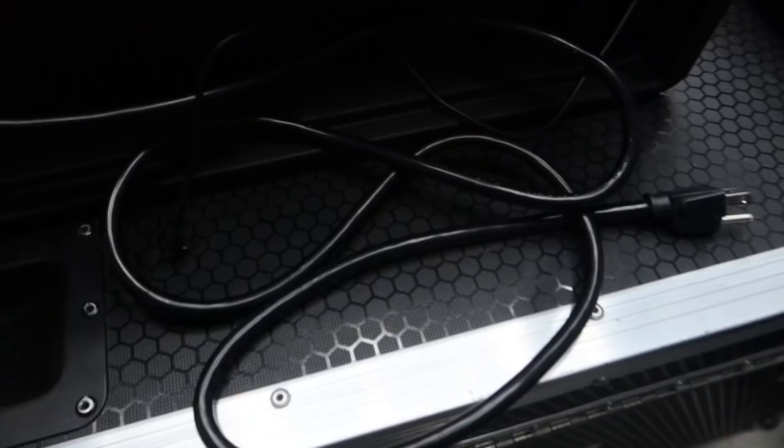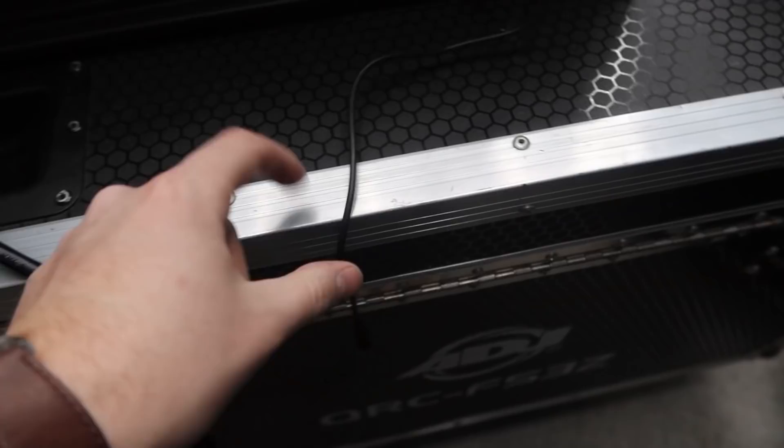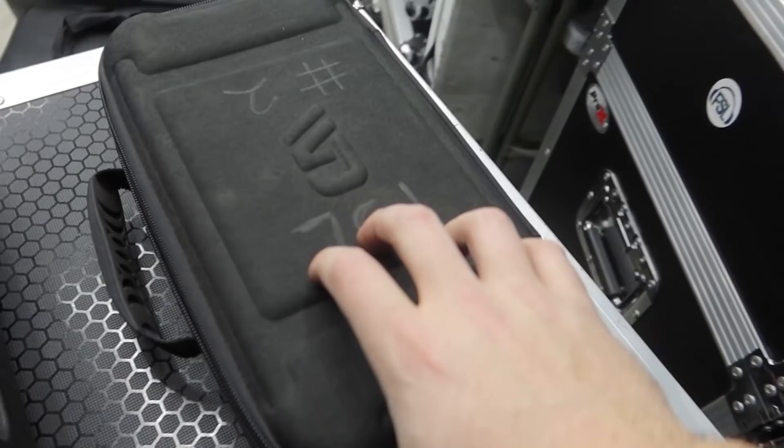The Audio-Technica does come with quarter-wave antennas first — basically the little tiny ones. When you do a passive combiner you do lose some gain, but by upgrading to the half-wave antennas we're basically keeping the same level of pickup from the original mics. Coming out of the back of that we have a power cable that we don't necessarily need but can use, and a power cable for our mixer. We have these cool little bags — I'll link all this in the description — that hold our Yamaha MG06 FX mixers.